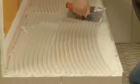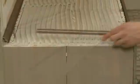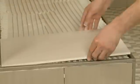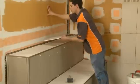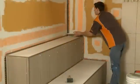As a decorative edging profile, we are using Schluter Quadec. The profile will provide a square, modern finish when installed. Though tiles are extremely durable, their edges are vulnerable to chipping and cracking if left unprotected. Schluter profiles are designed to produce a long-lasting installation by protecting tile edges from damage and are available in a variety of materials, finishes, and colors.